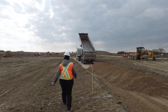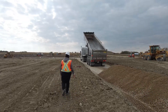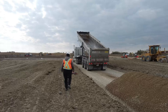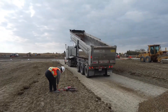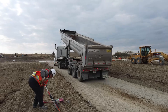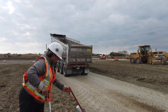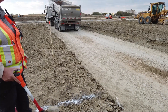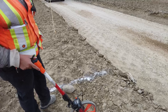This lane has an inverted crown, and it does have one CB in it — it's about down where the cab of the truck is right now. I will place this gravel completely flat and level, and 4 centimeters above final grade of the invert. Check out a video I made a couple of years ago titled 'Invert Crown in Lanes plus V-Blades.'